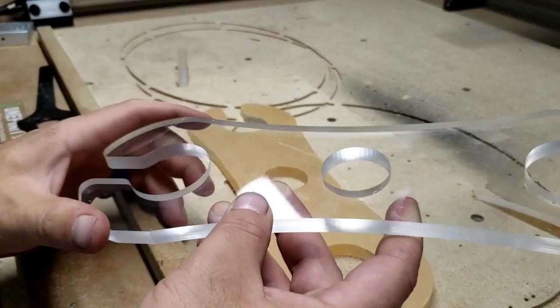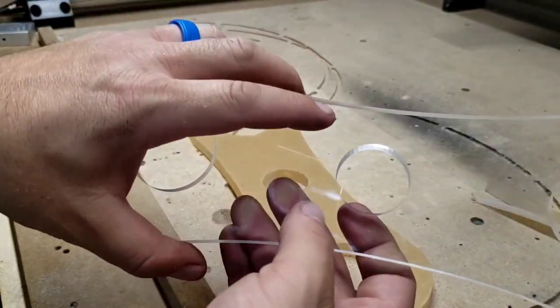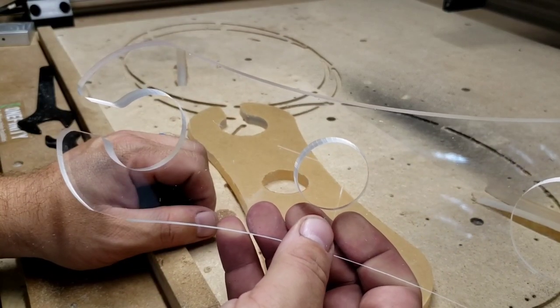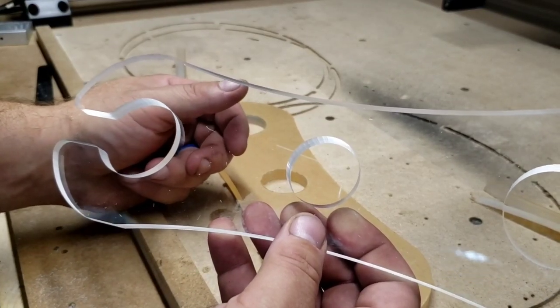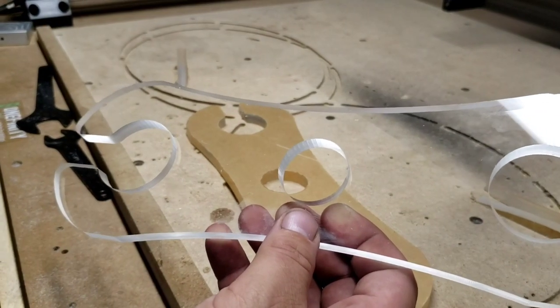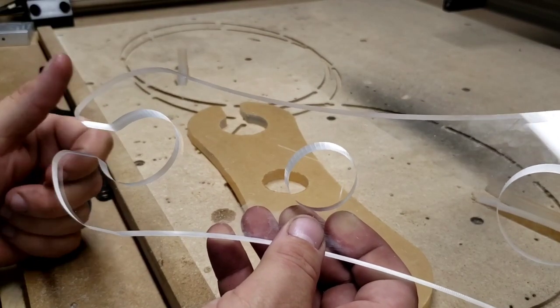if you want. Now, other people will just use a sander, take a pencil and mark it, and then that hole is 1 inch, I believe, or no, actually it's 1.375 inch diameter, sorry. So you just get a hole saw that's 1.375 and drill it out. Or you can jigsaw it out, whatever you want. Scroll saw, you can drill a hole and put a scroll saw in, either way.